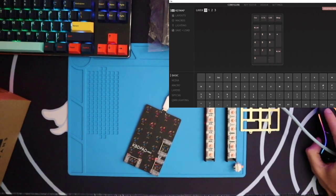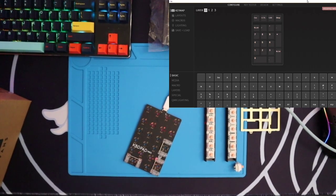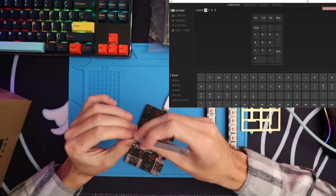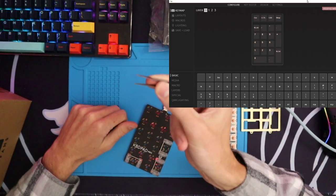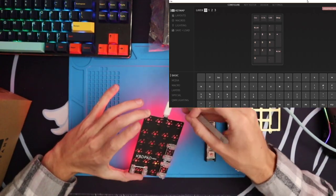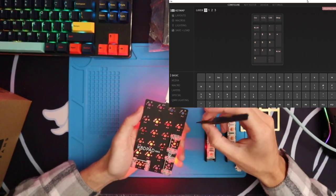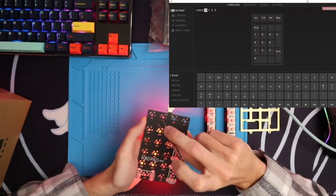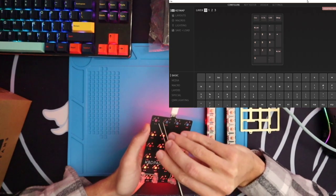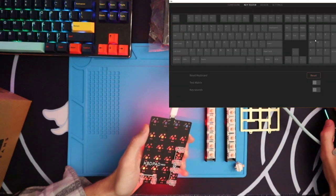And what that does is it allows me to test and see if all of the metal connections are operable and running. So what I do is I take a pair of tweezers like this, and I go to the actual metal inserts, the receptacles that I'm going to be plugging my switches into. So when I solder, they're going to go through right there. What I'm doing is just checking to see if they are making a good connection. Let me do this real quick.